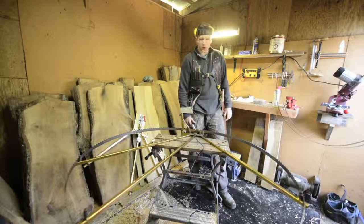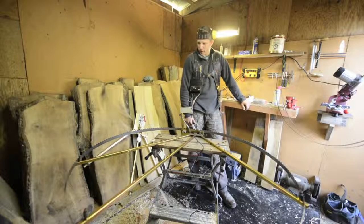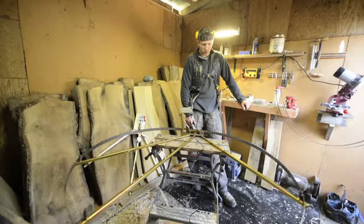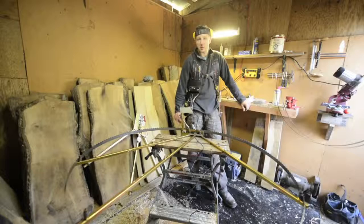I'm sure I'll get better and better at it as I go on. Hopefully I can cut my time down to about half an hour a blade. The tooth setting takes a lot of time, so it'll probably still take around 40 minutes per blade to set the teeth, sharpen, and be all said and done. That's just the reality of it. But this blade is sharp, its teeth are set — let's go put it in the sawmill, see how she cuts, see if I did it right.